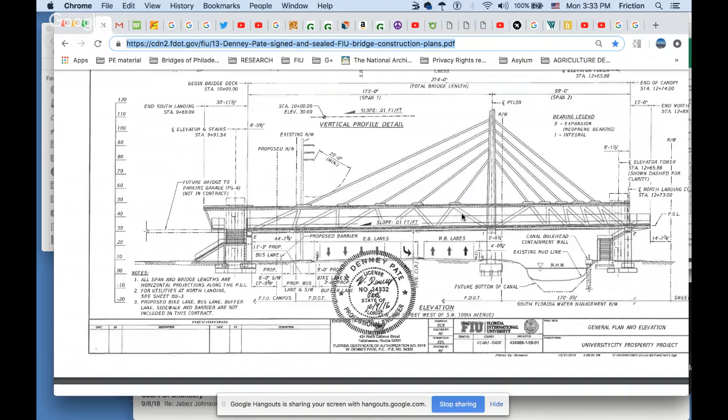It put the longitudinal rebar in tension, compression, which resolved itself by buckling outwards, talking about the rebar now, and then causing that to crack. Or it's the other way around, that this thing does have a little dip here and it pulled itself apart here in the middle, which I find that statement that I make to be something I can't make happen in my own mind, even though I'm leaving it open. I can't make that happen.